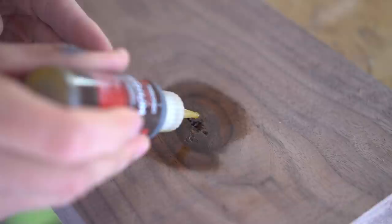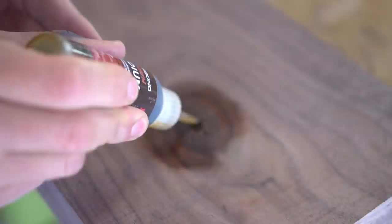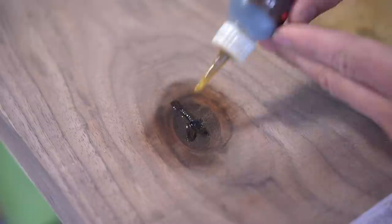After I had it all cut up, I did realize there were a few knot holes. But with knot holes, an easy way to fill those is just using some Starbond adhesive. This specific adhesive does have a pigment in it, so it's actually more brown. Plus, I spray down an accelerator first, so it dries extremely quickly and you can sand it even faster.